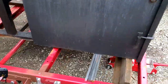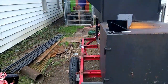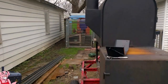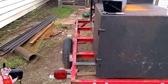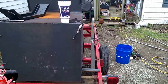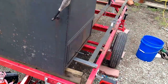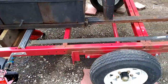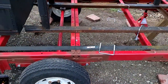I moved it over several inches because when I go to put sides on this, I was worried about how far the stack sticks out the back of the smoker and running into the siding as I try to put it down the side. I moved it over about four and a half to five inches. You can see I really narrowed down this opening - I'm still going to cover it with expanded metal, because if I don't, it's just an accident waiting to happen. Somebody could stick a leg down through there and get a broken ankle.